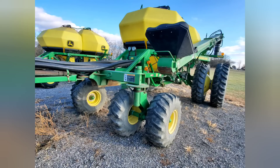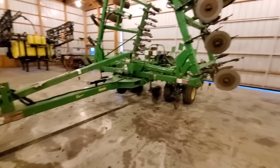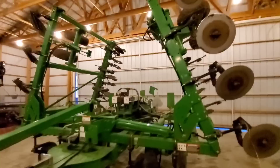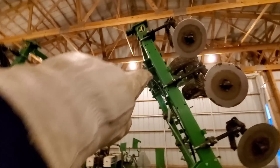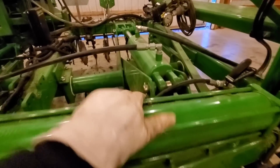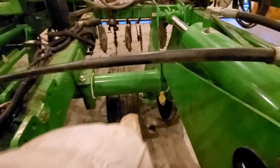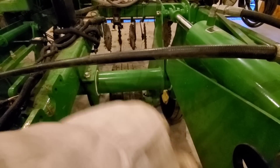In these photos you're seeing that 1910 cart hooked up to the 2510S Medium toolbar that we will be purchasing. That toolbar is fine — it's a 16-knife S Medium toolbar, and these toolbars are all the same. You can see the holes where the additional winglets would bolt on. When they go to 16s, they put a bigger cylinder in and add some additional lines — a hose routing kit because you have another set of folding cylinders. This one uses an 8-bolt hub with a 12.5L-15 tire, and the 16 had a special 18-inch tire for the additional weight the winglets add.